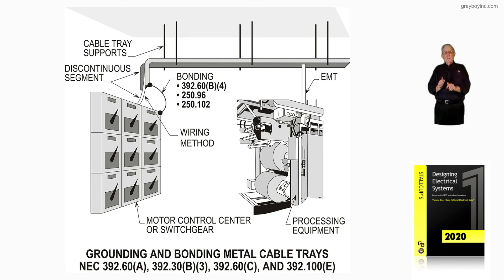You just can't come into an open top that remains open. You have to close it with a bushing, or some kind of fitting or covering, that will not allow anything to gain access — such as dirt, lint, dust, varmints, and things of that nature. This is a precautionary change to prevent damage occurring inside the equipment due to an opening at the top where the cable enters. And that's what this illustration is illustrating.